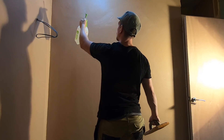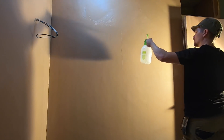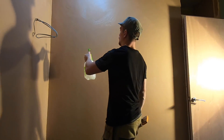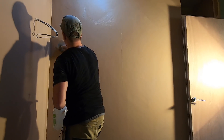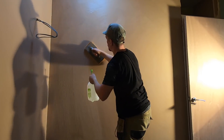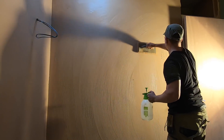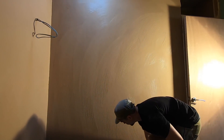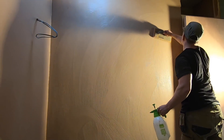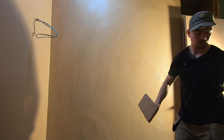Stage four: the only way I recommend doing one coat plastering is with a sponge float. I've done it without one — no good, promise. So what you do is put a light haze of water on your plaster using a spray bottle — only about a fiver, cheap as chips. Then using your sponge float you flatten, getting rid of any lumps and ripples. The sponge float really helps flatten your wall — figure of eight motions or long sweeps, just rubbing the wall up. It removes high spots and fills low spots, like floating with render but slightly less abrasive.